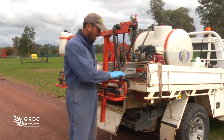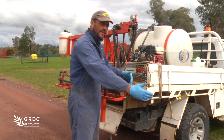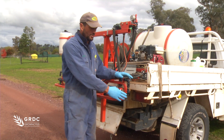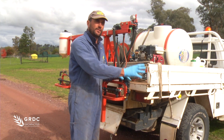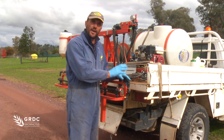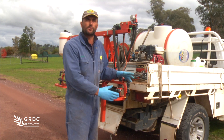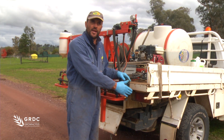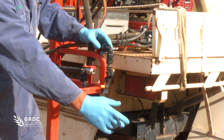On the end, I have a separate line running the NJet. It's really critical that we calibrate that and then match it back to our nozzles. A lot of the time these will put a lot of flow out, but if we throw them too far, we can be lower than our mix or dilution rate — and that happens quite often with the boom spray. They may be going at 60 or 70 litres per hectare, but if they haven't checked this, they could be down at 40 litres per hectare because they're throwing that too far. Really critical we check that out.